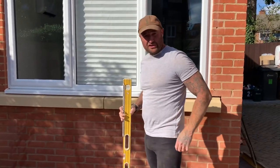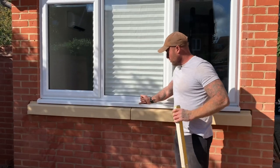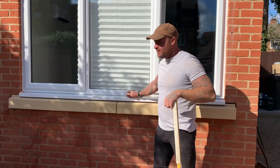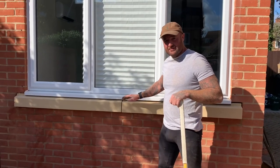Full apologies — I should have filmed that but we've only got two pairs of hands and it was hard getting the seal in. The mistake here is they've put the windowsill on, so we have minimal space to try and get her in. I didn't even attempt to lay her bed, so we've had to dry-pack the seal in just to get her in, and I had to use my trowel to wedge it.